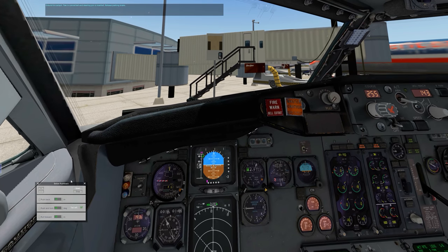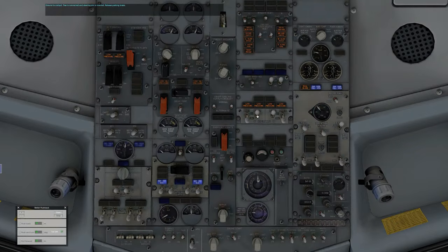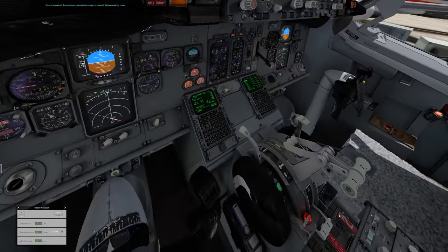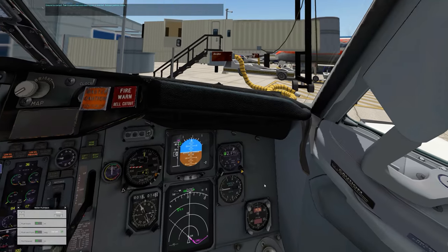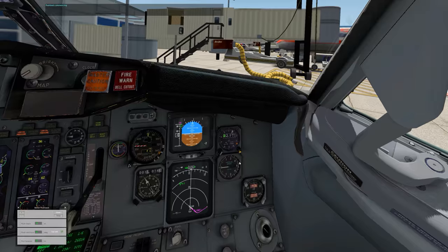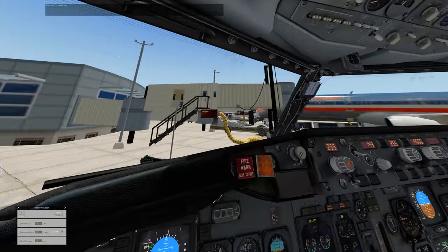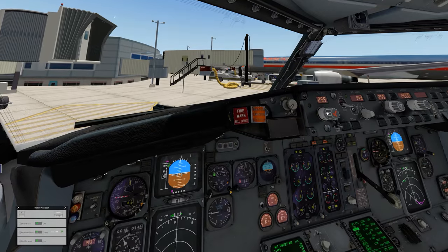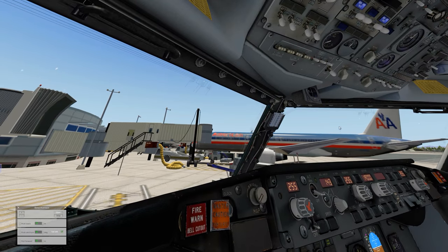Ground to cockpit. Tow is connected and steering pin is inserted. Okay, steering pin is inserted so we can pressurize hydraulics. And we got that going. So let's get the brakes released. So I'll just depress the brakes and start my left timer. And startup order will be number one, then number two, which is standard at United. So I'll position both pack switches to off. We got good starting pressure. So we'll start the left engine now. Oh yeah, we're clear of the gate.